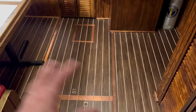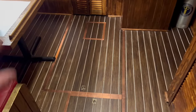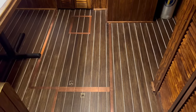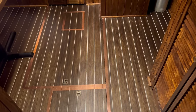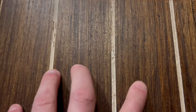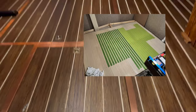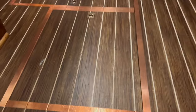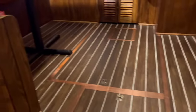After I measured it with my drawing and made sure the lines were where they needed to be, I put a batten down, followed the batten with the router. After the v-groove routing, I went back and filled all the lines with actual teak caulk that would be used on a boat — taped it off and filled in all the lines.